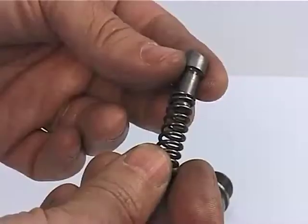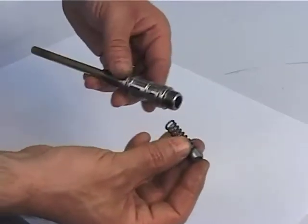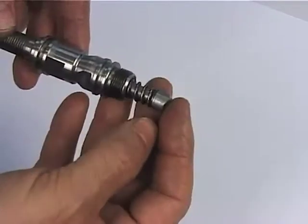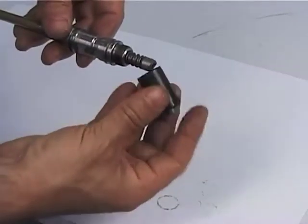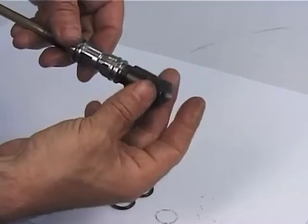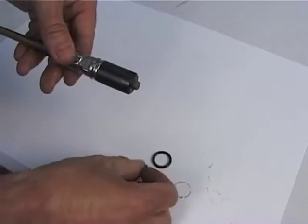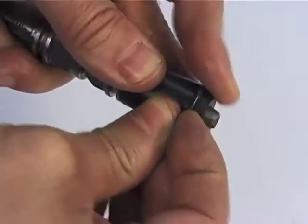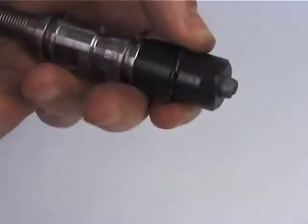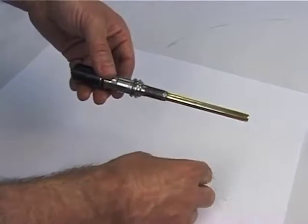Fasten the clamps opener in a vise, then insert both onto the cone holding head assembly. Mount the clamps holding cone onto the cone holding head assembly. Finally, assemble the O-rings. Warning: always replace the O-rings, figure 8, when overhauling the tool.